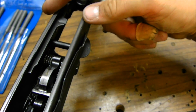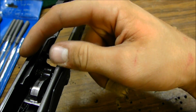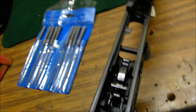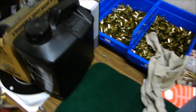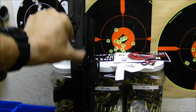I found out what was going on with the AK bolt. I was right — these rails right here were in a little bit too far. Right up here was great, but back here it started to get a little bit tight. I measured them with calipers and it was a couple thousandths off. Doesn't sound like much, but it was enough to keep the carrier from moving freely. Now with that fixed, I'll put this thing back in — it moves so much better. Before, whenever you'd pull it back it would just kind of stick there. Now it falls right back down just like it should.